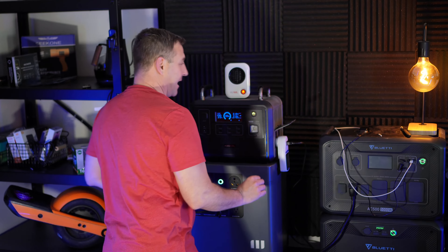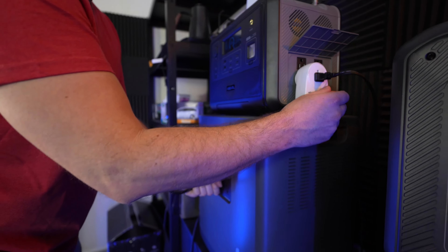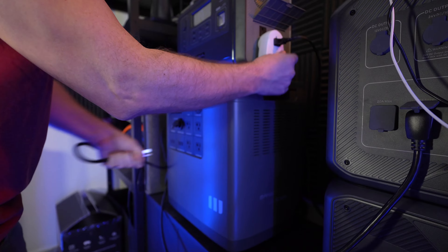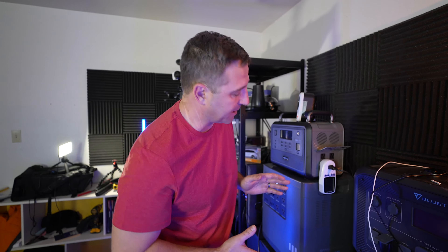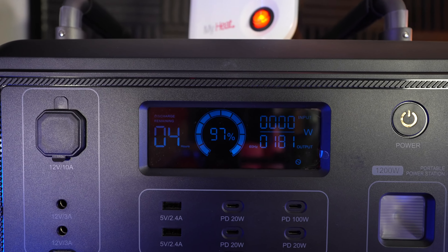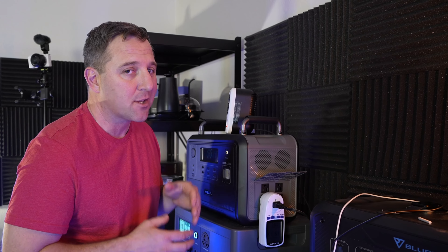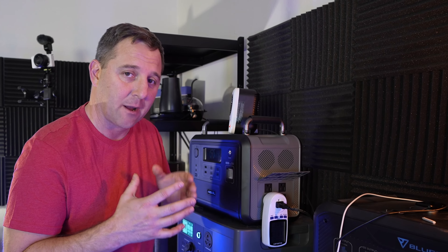The MyHeat heater has hit 194 watts, so let's unplug it and reset the watt meter. I'm going to reset it at the same time that I pull out the recharge cable. Off the bat, I did notice something with this battery capacity test: I'm getting a reading of 191 watts from the watt meter, but on the display of the P1201, I'm getting 181 watts — about a 5% discrepancy.